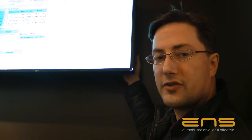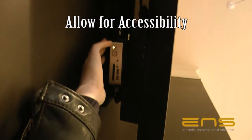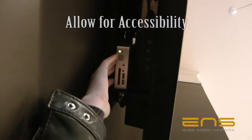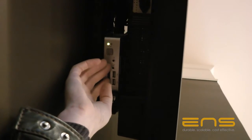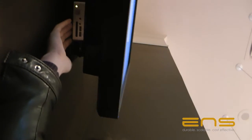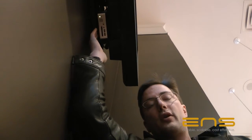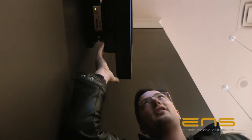One of the things we want to showcase is accessibility. It's so important to mount with these larger space mounts — not just because of angling, but because of serviceability. Come underneath and you'll see: everything is accessible — the computer, turning it on and off, the operating system on the compact flash, and all the cables and wires attached to the LCD. If this needs servicing, everything comes off as one unit. You simply unplug it from the wall, pick up the computer and everything together as one, pull it off the wall to service, then put it back in place.